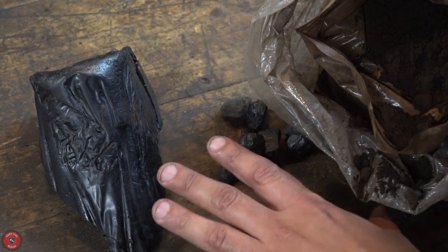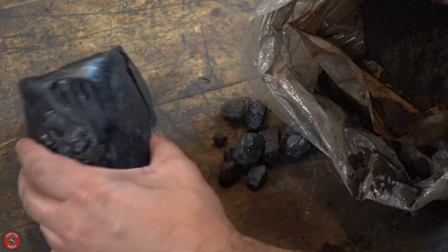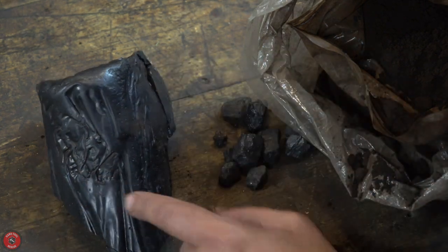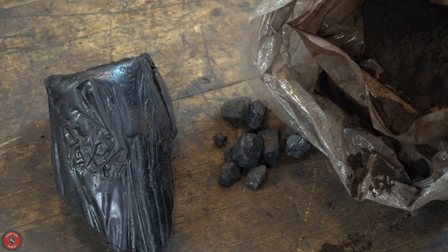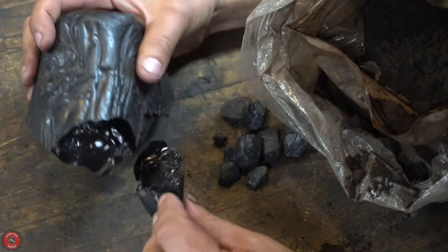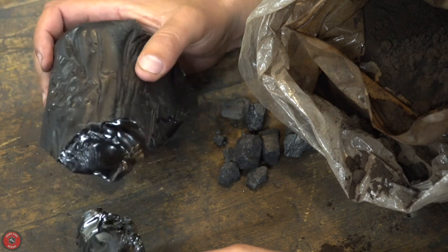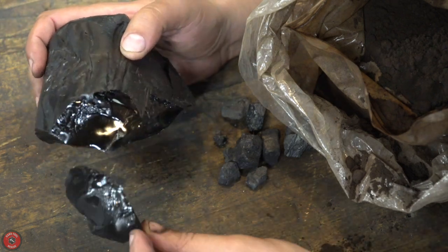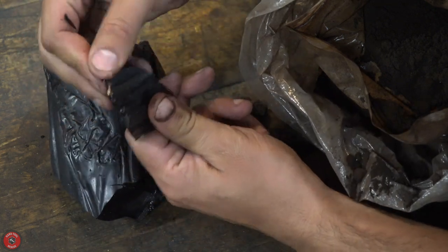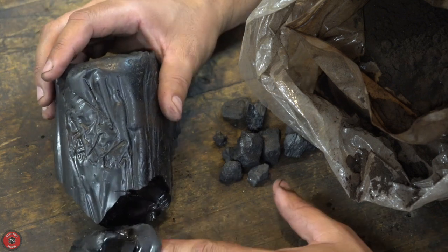Right here I have three ingredients that could be used to make Japaning, but only one of them is really accurate. This is just a block of roofing tar — a lot of people online seem to think this will work. I have found that is not the case. It's not hard enough. Even though it does look like it could be, and you can see the extreme glossiness inside, this is most likely synthetic, petroleum-based asphalt. You can bend it very easily without it cracking — that is obviously not a very hard finish. Something like this most likely won't work.